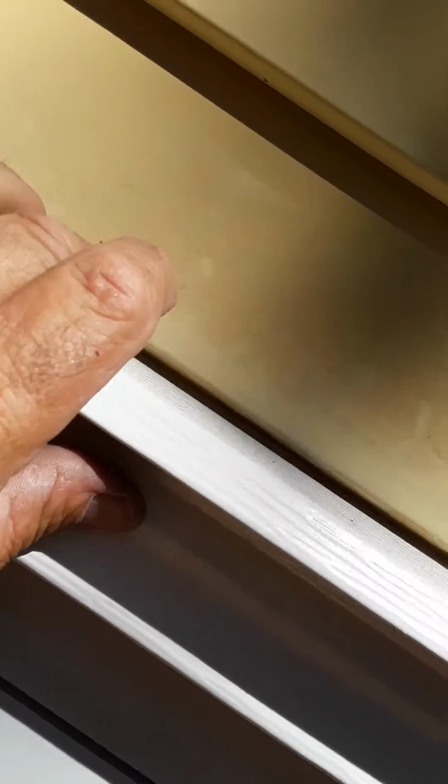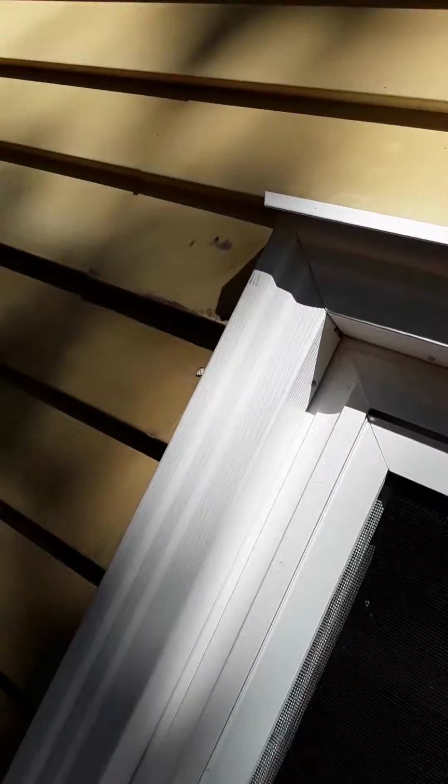Now this piece here, this is kind of floating. They left the center butt intact for me on this piece. The other side, they cut the center butt out, which weakened it a little bit. But I'll get this where I want it. I might stick a little trim nail right here. And then on the underside of this guy, I'll put a bead of caulk, and it'll make it match all the way through. So that's how these windows were done.